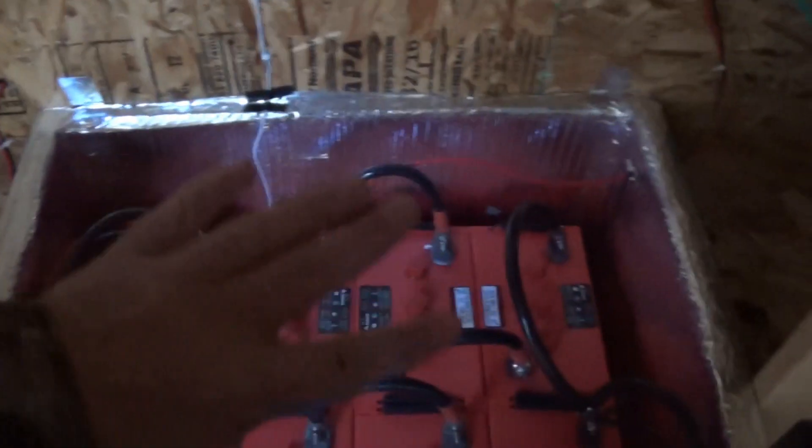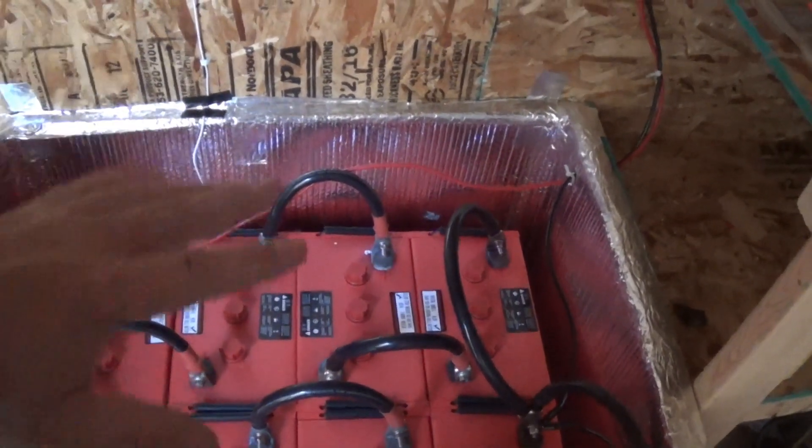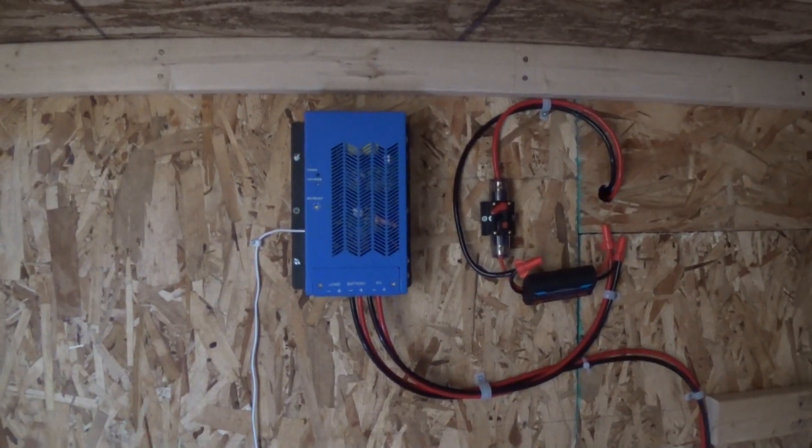Now, why did I go around here and then straight down? My lid isn't going to have hinges — I'm leaving it so I can lift it up and push it back against here or latch it open. This sensor wire is so thin it won't affect the lid at all, but those other wires are six gauge and thicker, so they would. This way I go around them, and if I want to add hinges later I still can. That's why I went straight down — that's the battery temperature sensor for the charge controller.